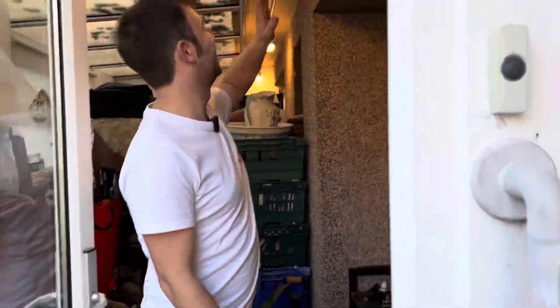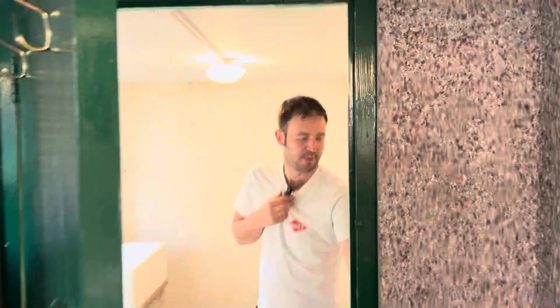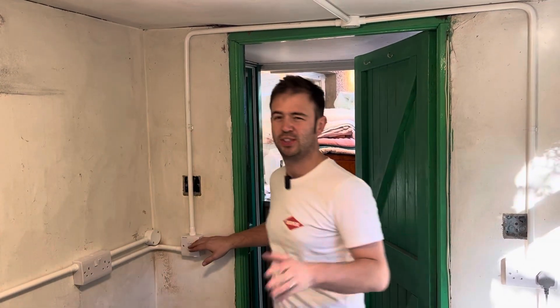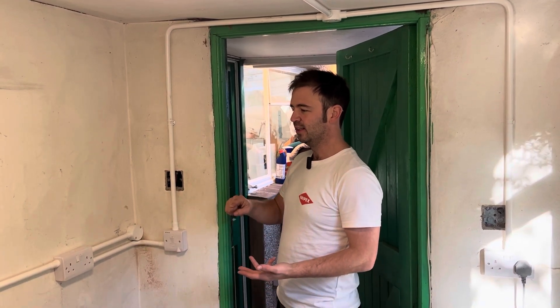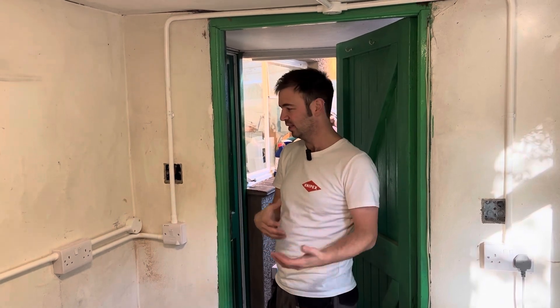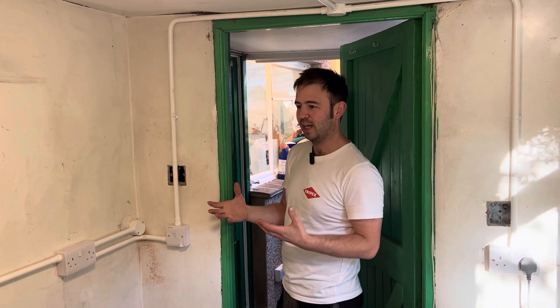Again a tricky ceiling in here, so we've done straight surface conduit — it's two-way intermediate and a two-way. In here the client has a dedicated radial just for this room where he's going to have his washing machine and fridge freezer. I've labeled some of the areas — things like the immersion heater, the pump, the dedicated radial, that red socket, and the underfloor heating spurs tucked away in the loft — so the client can find them if anything trips or needs isolating, since he's a fairly enthusiastic DIYer.